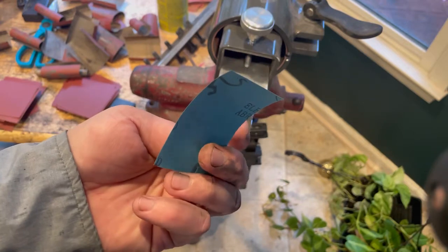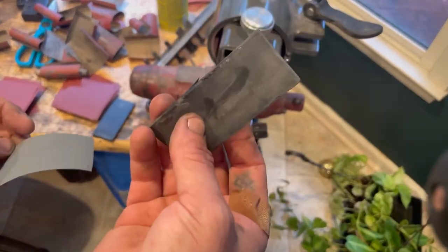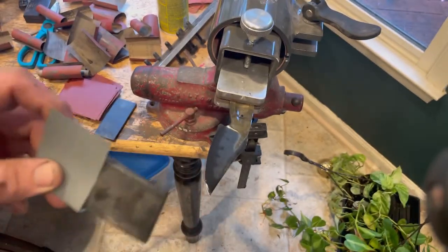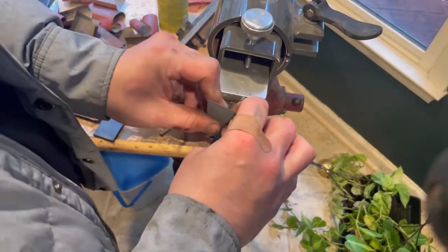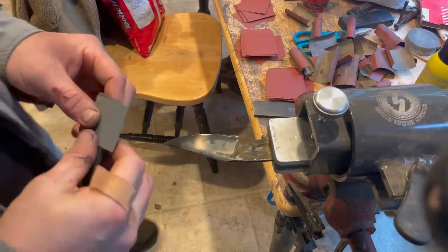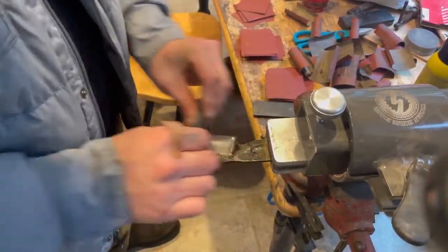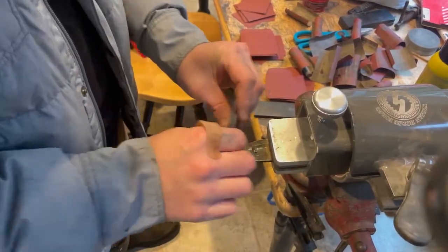So this is 2500 grit sandpaper. I'm going to use this to take all the oxides off, and I'm going to use that hard rubber sanding block to do the sanding. And the reason why not neutralizing works for me is I tend to get straight into the sanding really quick, so the acid doesn't really have a chance to continue etching the blade.